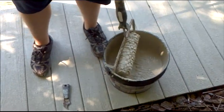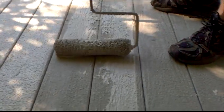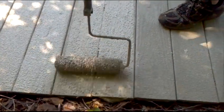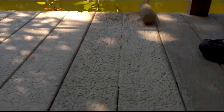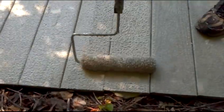For the second coat, roll it on to get good coverage — roll it on an angle. You have to work the edges when you do that roll from the side so it gets that line out and doesn't get in between the boards as bad. Getting all the ends — ninety percent of the time it's going to be the worst right on the edges just because of exposure. Come back with a clean pass and clean out the inside, then run another couple passes just to get the texture right.